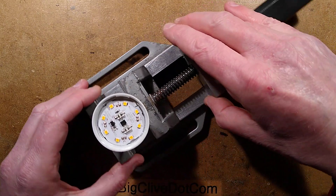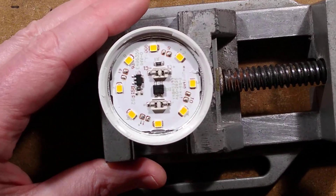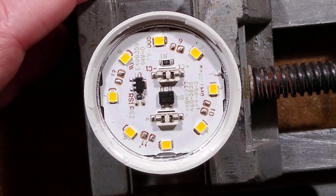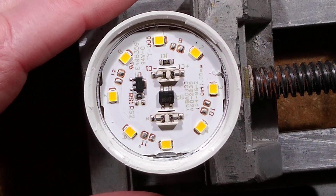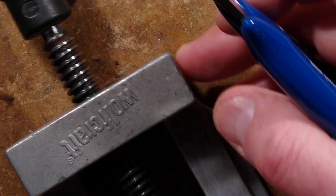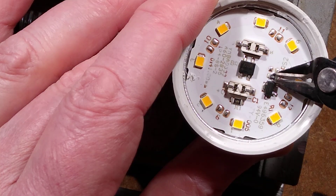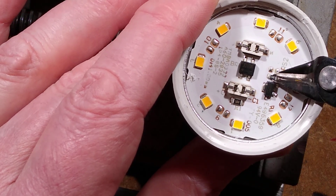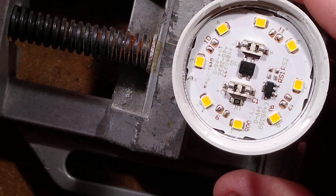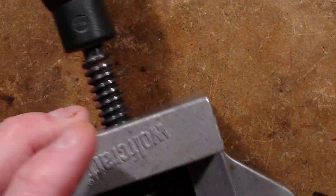Here is the bit I'm going to be working on — let's zoom in and focus on it. I'm going to actually just cut that resistor off because it's easier than desoldering. Unfortunately these aluminium substrate PCBs tend to be quite absorbent for heat — that's the point of them. They dissipate heat so well that it makes it very hard to solder on them.